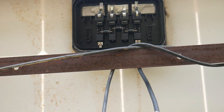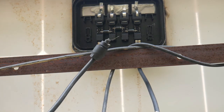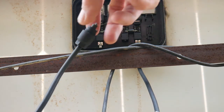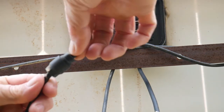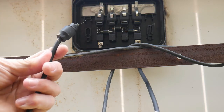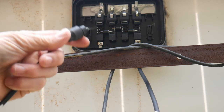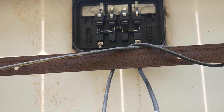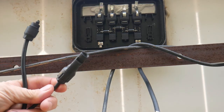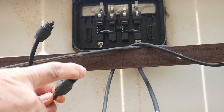As you can see, the panel has been damaged. The good thing is that it still produces charge — you can still use it — but obviously it won't charge as much as you'd like. What you can do now is reconnect the cable that has been ripped. Very easy: just loosen the screw here, clip the cable in, and reconnect it. Then close the cap and that's it, you're done.